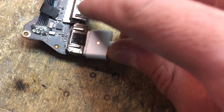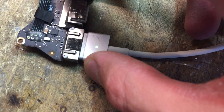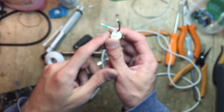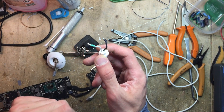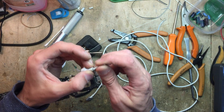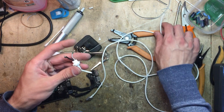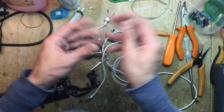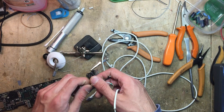So it's red. Plug it in — it will first get green, and then red. What you could do is: you can drill a hole, remove the two wires, then remove all the other residue from the wiring, thread the new cable in, put some glue on the other end, and then just solder it directly to the PCB of the power supply. And you're done. It will look pretty much as good as new, and you've saved 80 euros.